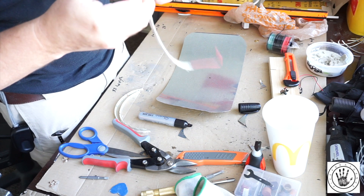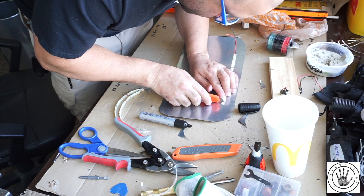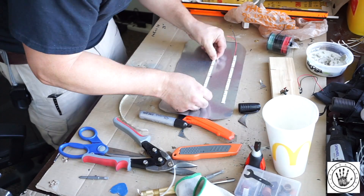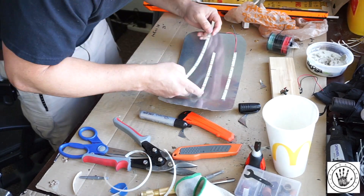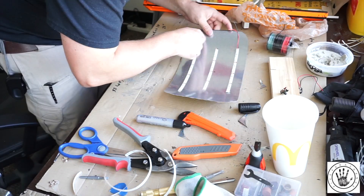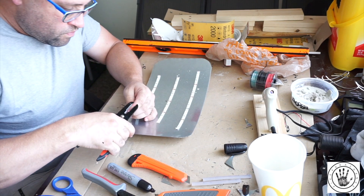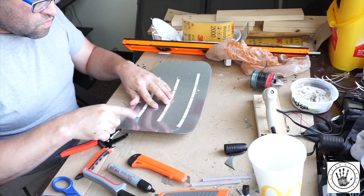What I'm doing here is cutting off the waterproofing that exposes the connection so I can connect the wires on to the next one. What I did here was cut the wire that was already pre-attached to it — it had a connector — so I took the wire off and now we're gonna wire this up. What we're using is 22 gauge solid wire for the connections.